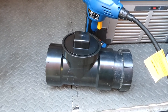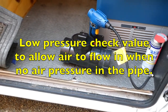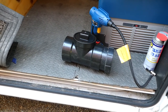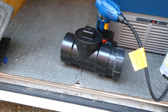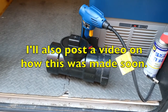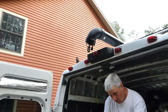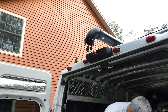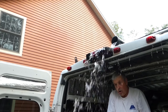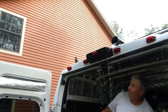I might not be able to pressurize it very well. I might also get a check valve for the top, which would allow it to drain under gravity instead of getting airlocked as it does now — no water comes out even though there's water in the pipe. This is probably not the final design, but it'll work for the summer until I can get back to Massachusetts, where they have ABS plastic pipe — they don't carry this stuff in Maine. I'll post links to all the pieces and parts in the video description. Thanks for watching. By the way, when you build this, let your PVC cement cure a little while before you pressurize it — or this might happen to you. Shit. Too wet.